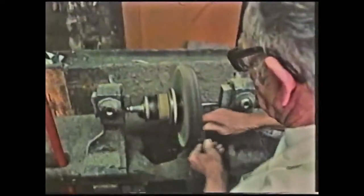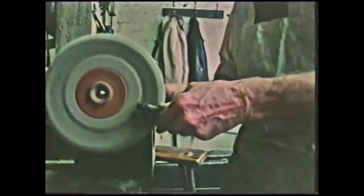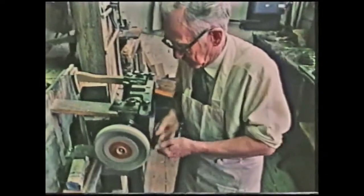Once the craftsman has checked that the handle is satisfactory, it goes on to the polishing stages. First it is glazed on a wooden wheel covered with felt and dressed with either fine emery or aloxite. Next, it goes on to a 12-inch coarse dolly, driven from the same central power supply. This dolly is of stitched coloured cotton and is dressed with a compound of fat and brick, known as a composition brick or a dolly brick. Finally, the handle is glossed off on a white, unstitched dolly, which brings it to the high shine and perfect finish which is necessary for high-quality silver work.